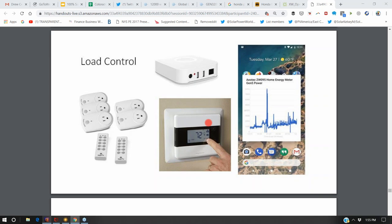We got two plans for that. Plan A is to use intelligent load controls so that when the hot tub really cranks up, the thermostats in the house stop the air conditioning from cranking for a little bit. Now, not forever, just until the hot tub stops cooling down. And then plan B is the old school manual transfer switch that can switch them over to grid power and back onto their full 48 kilowatt, 200 amp service.